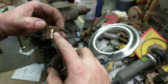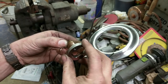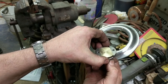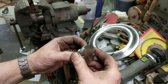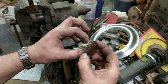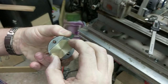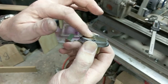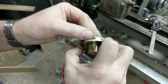I did a little filing to clean up the roots where the circular path of the tool had not cleaned up a square shoulder — these edges were just maybe a few thousandths too thick, so I cleaned those up and now it fits and slides clear. I left this a little thick on purpose, so I'll chuck it up and take off another — I'll measure it with a depth micrometer — looks like another four or five thousandths. I took off about eleven thousandths to get it where the surface is actually about two thousandths shallower than the holder, so that when it bolts in tight it can still slide without hindrance.